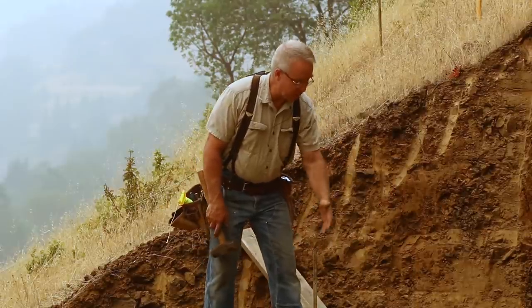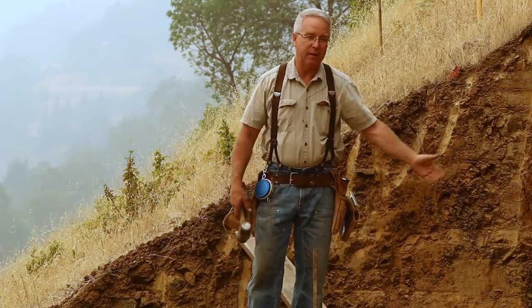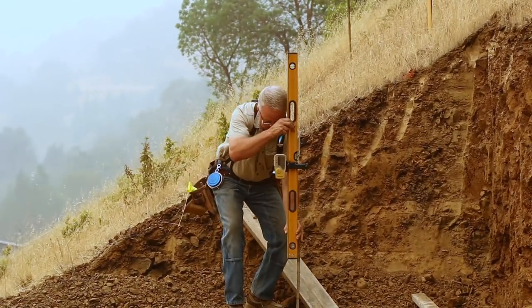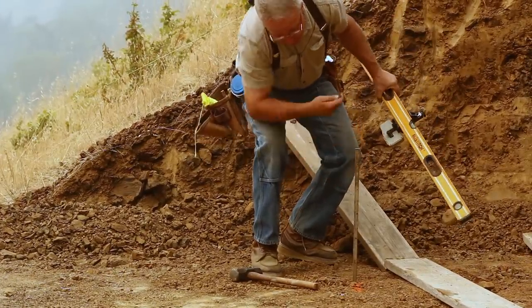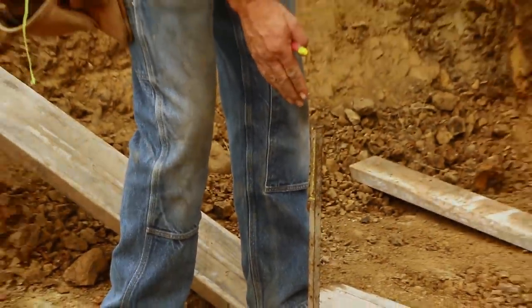I've established this as four foot plus from the average cut back there because the footing needs to be four feet wide. Now I want the grade. Top of footing — that's a top of footing elevation. That's the right distance from the bank.